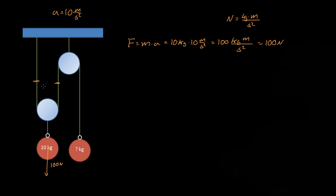Now, since the rope in a pulley system — if it's the same rope — must have the same tension, these two ropes must have the same tension. So we divide by two since there are two of them holding up this 100 newtons. This side must be pulling it up with a force of 50 newtons, and this side must also be pulling it up with a force of 50 newtons.